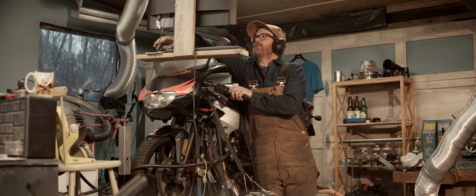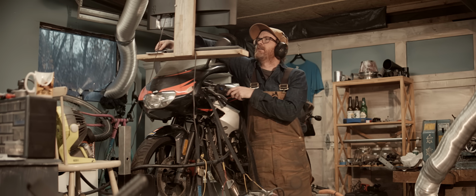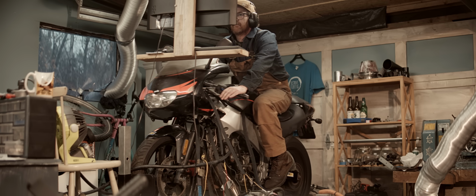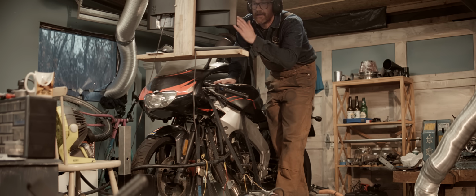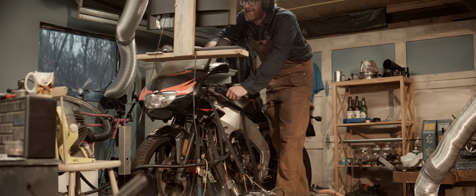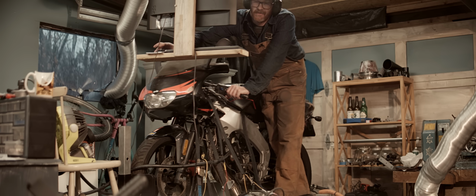Let's bump it up to 30 degrees, but then bump it down earlier. 12K, bump down. Well, ignition timing definitely makes a difference here, but we're not gaining power from it. It just makes it run or not run. So ignition unit malfunction seems to not be the problem.